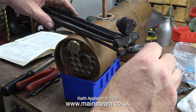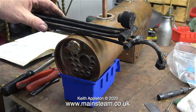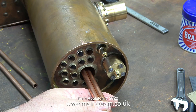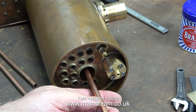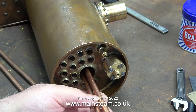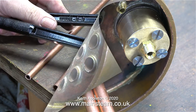The original, now-scrapped boiler from the Simplex was a Super Simplex boiler with three superheater flues. The new boiler, which is very well made, only has one. I could not modify the old superheater element because the piping, even though it was stainless steel and welded, was only a quarter of an inch in diameter. I looked at the feasibility of modifying one element to fit this boiler, but one superheater element of a quarter-inch diameter wouldn't pass enough steam to feed the cylinders. The engine would run but it would be down on power.